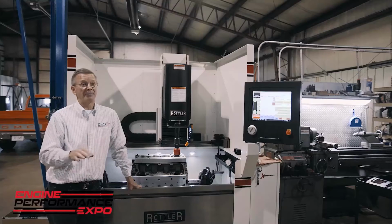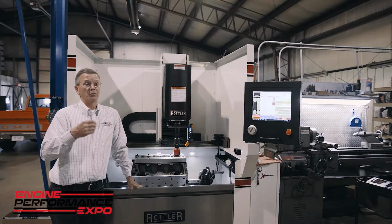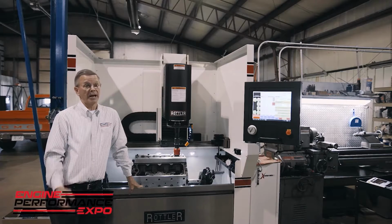So what I'm going to do today is talk a little bit about surface finish. First, I want to tell you, I am not a ring expert. I do not know, or care to try to estimate, what rings need as far as surface finish goes. That's not my area of expertise. My area of expertise is giving you what the ring manufacturers call out for. In other words, the RPK, the RVK, and the RK parameters. Whatever you have there, I can help you get those particular numbers that you need for whatever application you're going to run. So with that said, let's get started.